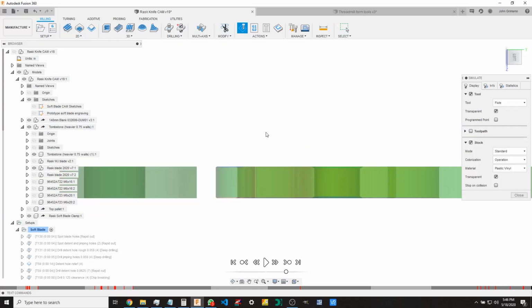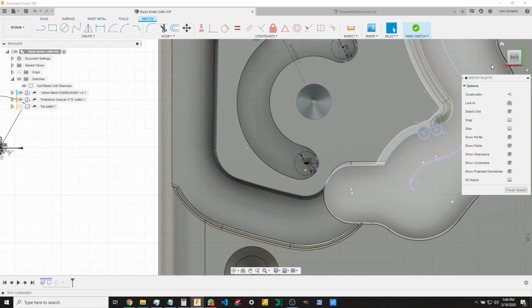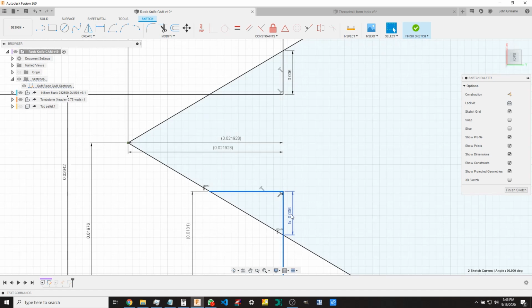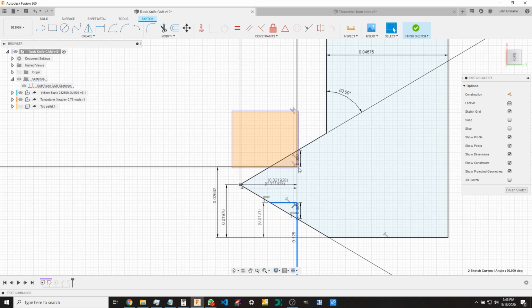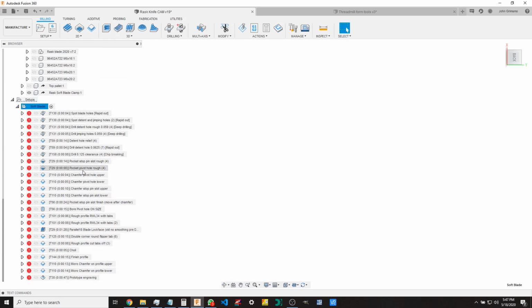Okay, so after quite a bit of math, let me show you my sketch. I drew my thread mill here, and then I basically faked in a lower chamfer and an upper chamfer, and I added some dimensions and some linkages. I figure I want the chamfer to be about halfway up the tool, and this was all theoretical until I go to here and prove it. And if I simulate those,